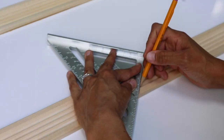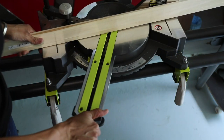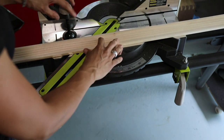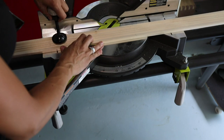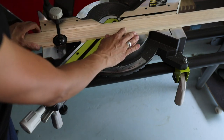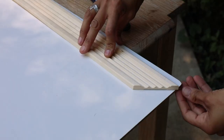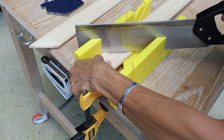And then you will be heading back to the home improvement store for more wood. So go ahead and mark that 45 degree angle, making sure you mark it in the direction that you're supposed to cut. I've turned my machine at 45 degree angles, quickly made the cut, and then I was ready to move on to the next piece. And after every single cut, check the piece and make sure that it fits. Check it at each corner because sometimes you do leave a little too much.